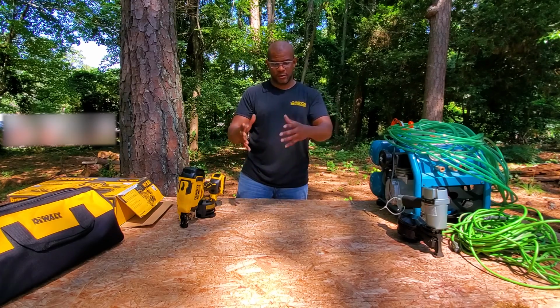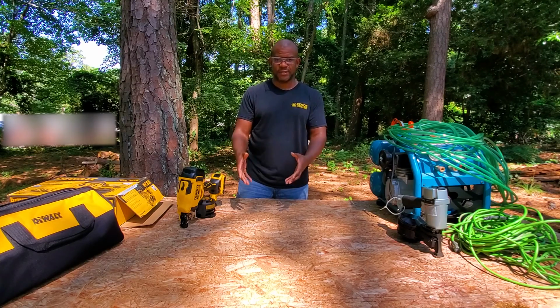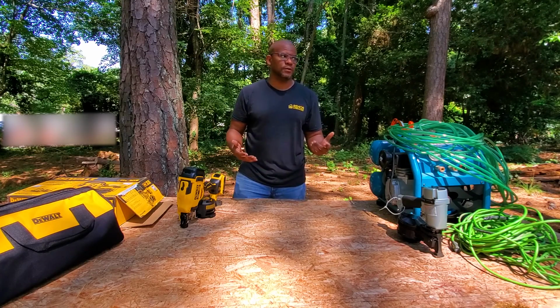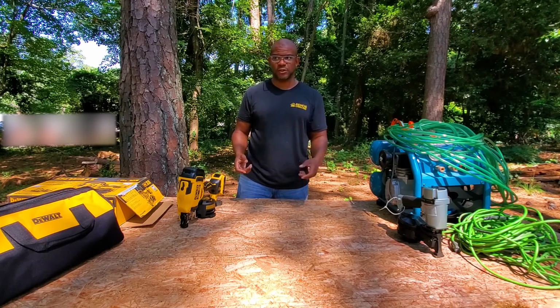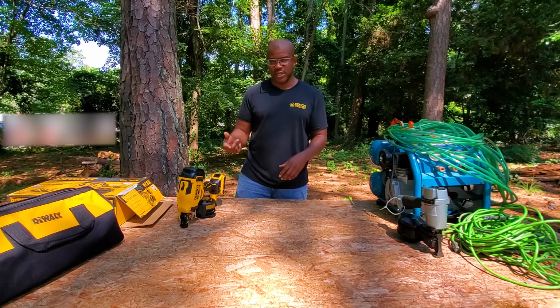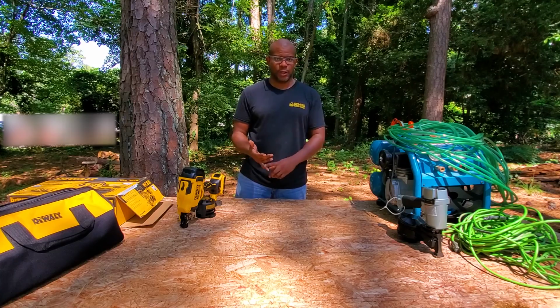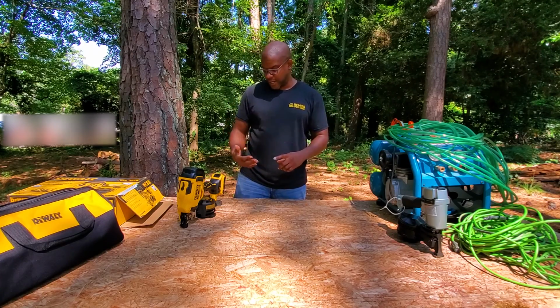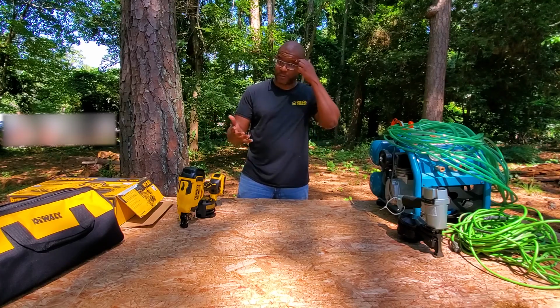Generally speaking, if you're just repairing the area right there around the weather meter base, then we're talking about, you know, 6 or 7 shingles, less shingles than is in a bundle. So one bundle of shingles will be able to let you do that repair in its entirety. That's an easy and quick way to get that repair done, and I'm sure that the property owner is going to love you for that.